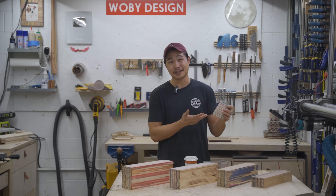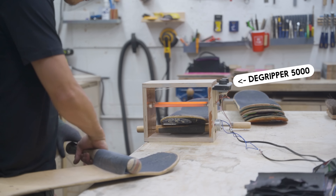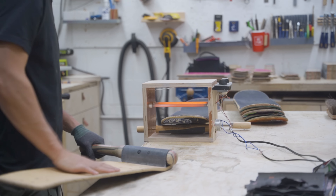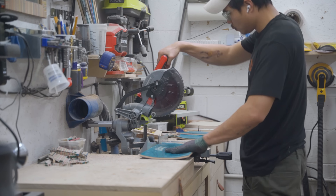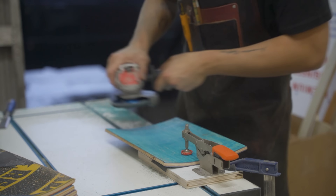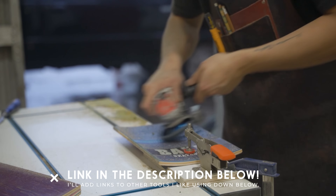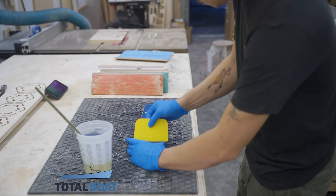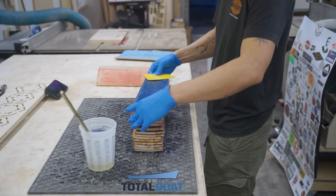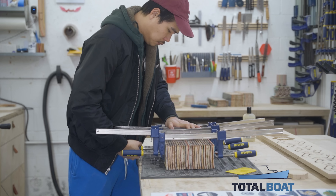So for this one I want to try to do it a lot faster. Over the holiday I made a bunch of these planks out of skateboards. I picked up 10 skateboards per block and ended up using 40 different skateboards for this project. I peeled off the grip tape using the Degripper 5000 — it's literally just a toaster oven with a slow rotating motor — then cross-cut them into different sections, using just the middle portion, and sanded down to bare wood using an angle grinder with a carving disc.